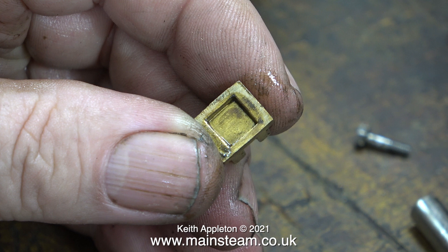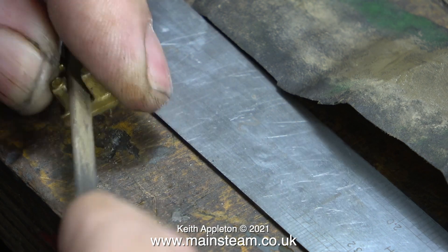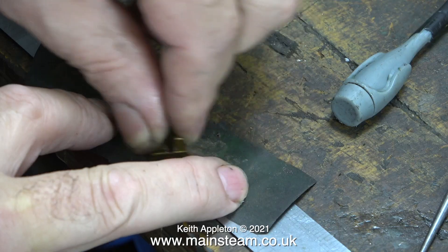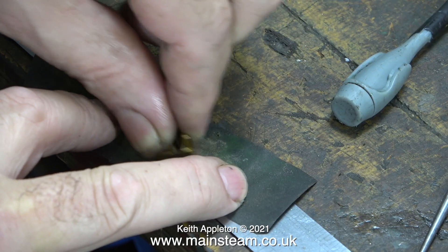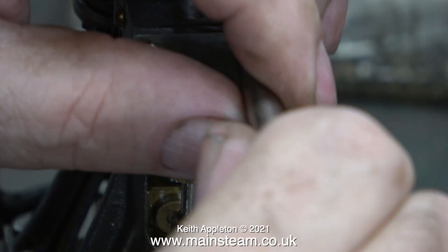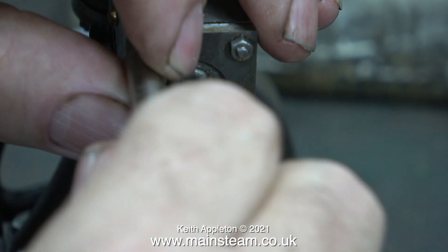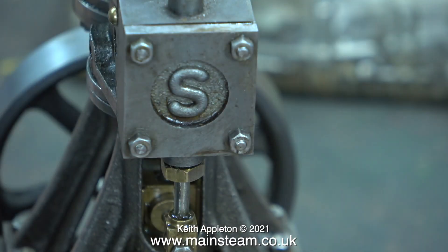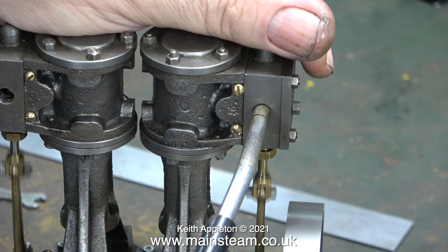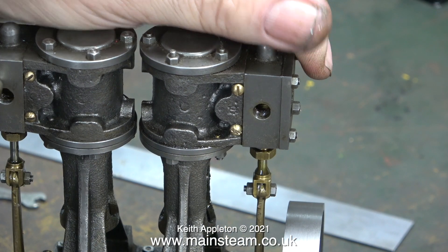It's still not machined, not cleaned up — just as it came out of the packet. I'm giving it exactly the same treatment as the other slide valve: filing the slot so it's a nice easy fit on the crossbar, and once again lapping the valve on a piece of wet-to-dry sandpaper on my ruler. After refitting the steam chest and the valve pin and connecting the air, this side of the engine definitely runs better than the other side.